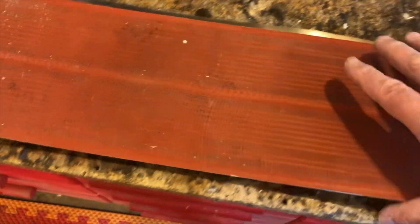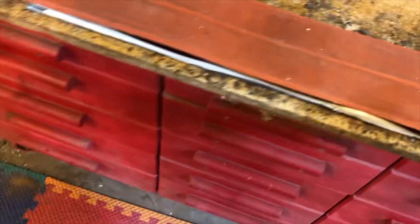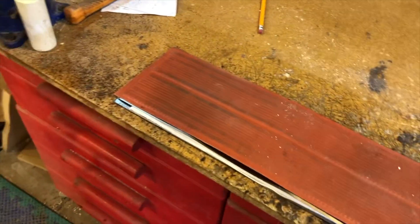My slat and the blanket on top. The reason I put the blanket on top is you can see the pattern of the heating element. If you get that against the wood, when you finish, you're going to find that pattern in your wood, and that's not a good thing. So next step will be going to the bending machine.